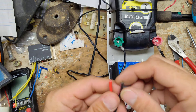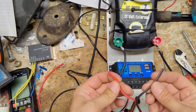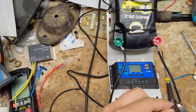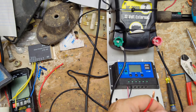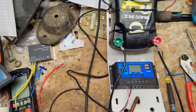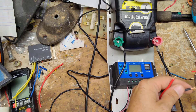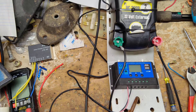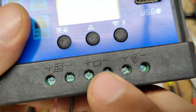So I've got this black and red wire. We're going to strip that back. The gauge wire is not real critical because there's not a whole lot of amp draw in this sort of stuff. We've got 14 gauge wire right here — this might even be a little too big. But 16 or 14 gauge wire works fine for this sort of stuff. It doesn't have to be 12 gauge or 10 gauge wire because you're not dealing with high current.